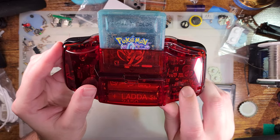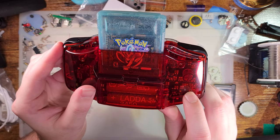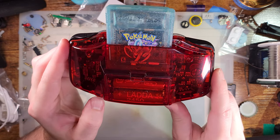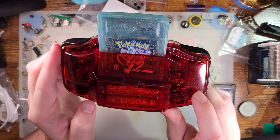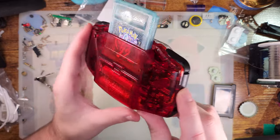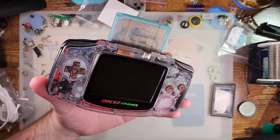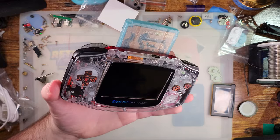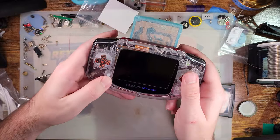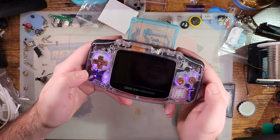That's what I'm guessing, that whole diode, or, yeah, I think those are diodes, plus those resistors. I think that's what that's for. That's just the cheap level shifter way of sending the inputs through a microcontroller that doesn't necessarily support the voltage level that the buttons are normally running at for the Game Boy SoC. But anyway, all in all, really neat board.